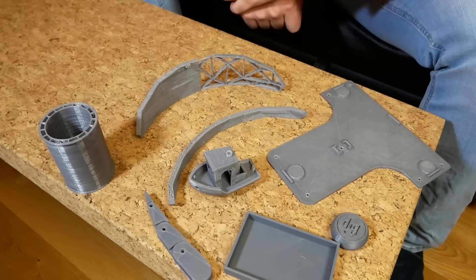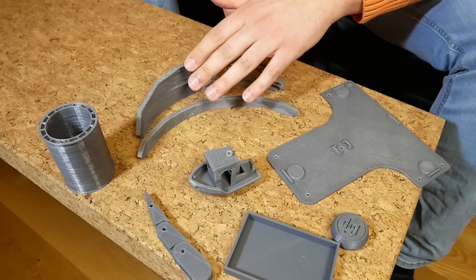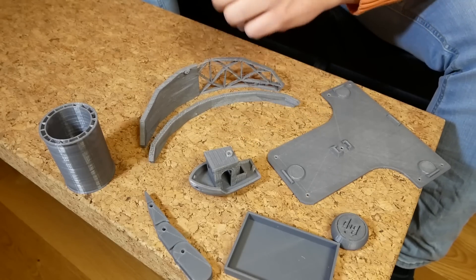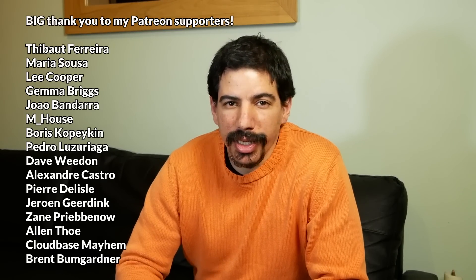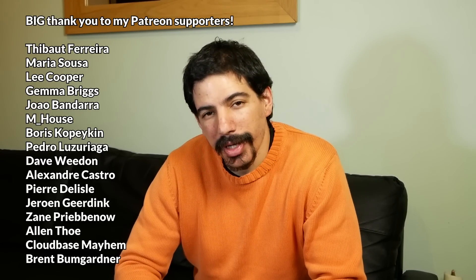There are definitely some problems that are problems with the printer, and others that are just a learning curve — I've done the wrong thing, especially on those last two, with layer height too high and probably too thin to hold on to the bed. That's the general feedback — it's a work in progress. I'll now be able to print my own parts for upcoming projects, which will be quite useful. I would expect this not to be for the majority of you, but I find it fun to figure these things out. Thanks to my Patreon supporters — it really helps. Consider supporting me on Patreon, subscribe if you haven't already, and I'll see you soon with some really cool projects I've been working on for a long time.